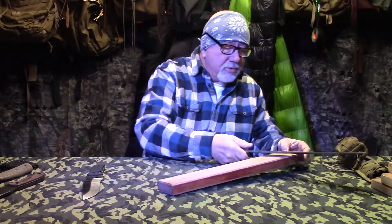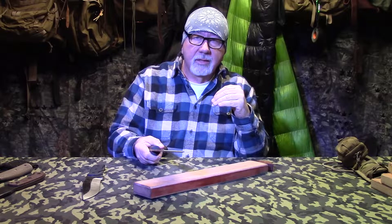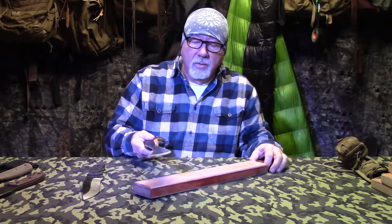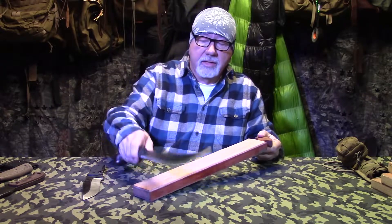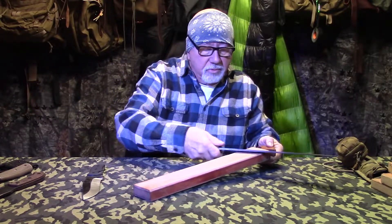I was asked if a razor strop will work - the answer is yes, it will. But the thing with the razor strop is you've got to put a lot of tension on it. Remember, it wasn't made for a knife - it was made for a straight razor that's very light. So you've got to put a lot of tension on it to keep it nice and straight, otherwise you risk rolling the edge. With something like this on a rigid background, it's not ever going to bend - the edge is always going to be true.